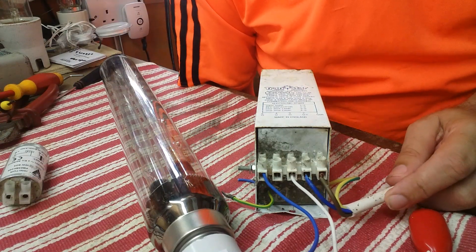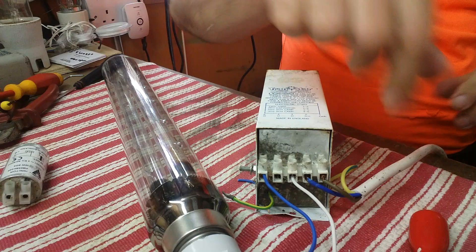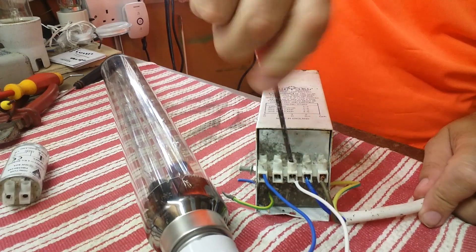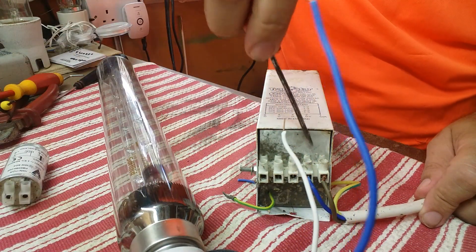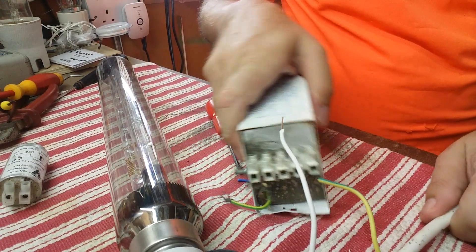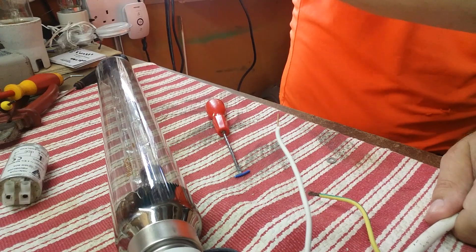That's a good example of the common problem with these ballasts. Let's see if we've got time — we'll undo this one, swap the ballast over, and try the Siemens on there. I've got about 13 minutes on this card in the camera. Let's take all this out, chop it over, and see if we can get the Siemens one to fire this up. We know this lamp is going to require an external igniter, so the igniter issue is noted. Let's wire the Siemens up — different wiring diagram on there.